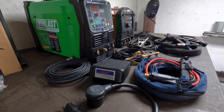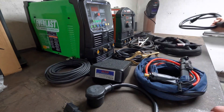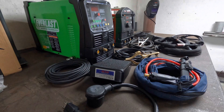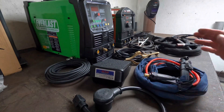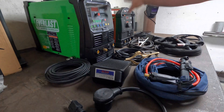As far as going from 120V to 240V, I like the Lincoln a lot better. With the Lincoln, you simply plug or swap the cord in the back of the machine. On the Everlast, the 220V cord is hardwired in, so you've always got a long five or six foot cable to deal with, and changing down to 110V means plugging in an additional cord. That makes it more of a pain for portability — with the Lincoln you can take everything fully off so you're just moving the unit, whereas the Everlast always has a tail of cord dragging around.